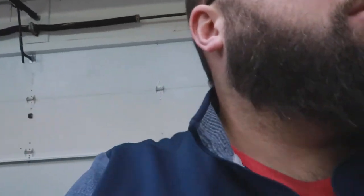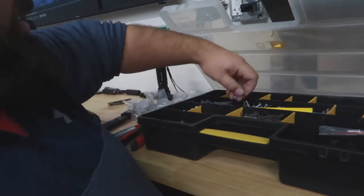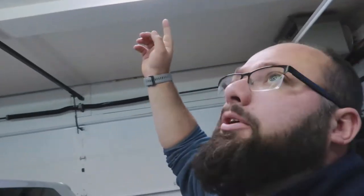I am not going to use anchors — I'm just going to use deck screws. I'm not going to waste my time with those; these lights are pretty light. I think the screws will hold, and if they don't I'll go back and use anchors. But we don't have earthquakes here, so I don't think these are ever going to fall out. Those existing ones are also just screwed in the same way.